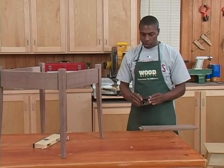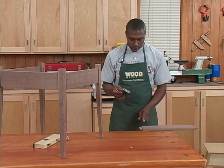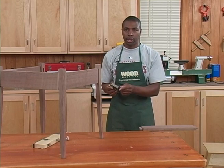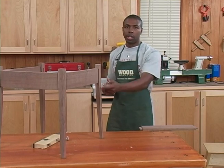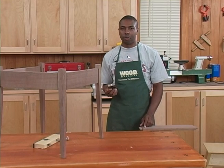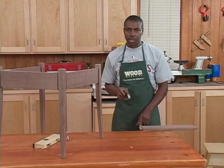In very few situations in the use of the shoulder plane are you going to be doing along-the-grain types of cuts. The nature of the tool is to trim the cheeks closer together to fit inside of a mortise and to trim the shoulders to get a good, light-tight fit perpendicular — or whatever angle you want — in relation to the vertical members. Those cuts are always against the grain. I wanted to show you one of the hazards of just this type of cut.